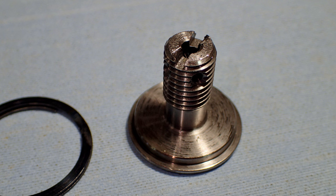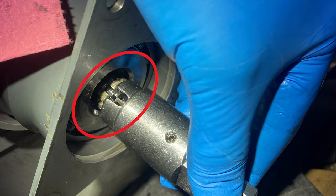If you end up putting the flathead screwdriver piece inside of there to try to counter-hold the torque, you're going to wreck that threaded bolt. Then the next time you try to torque it, you won't be able to, because the flat-headed screwdriver piece won't fit into the threaded bolt and be able to hold the torque that's required. All right?